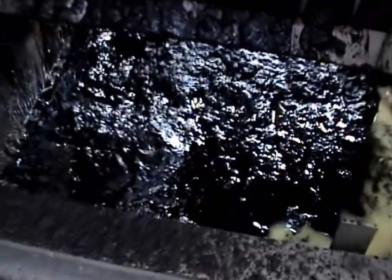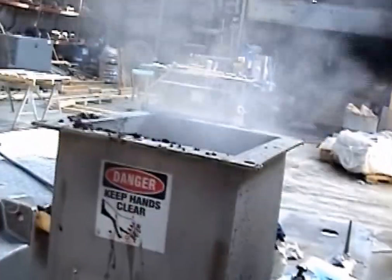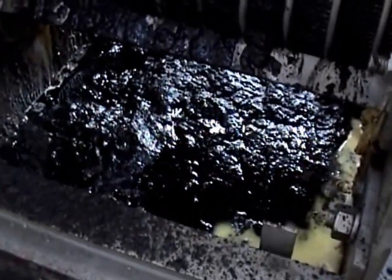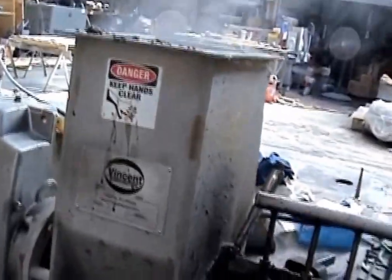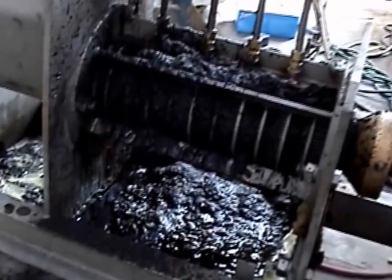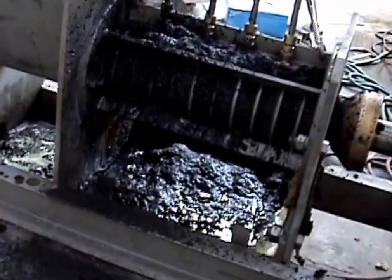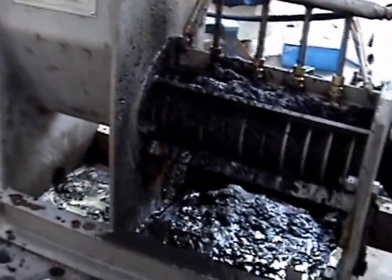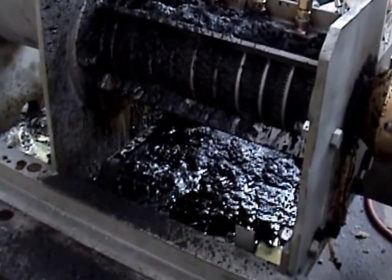Normally the sludge that would come through is filtered out of the press liquor, put back into the screw press along with the other stuff going in. That is the fines that get through the screen. We count on filtering them out, putting them back in the press, and catching them the second time through. There's a circulating load in the press liquor, but it means that the only liquid leaving the system is the filtered press liquor. That would be going in ahead of a centrifuge.